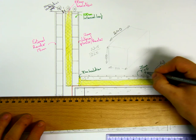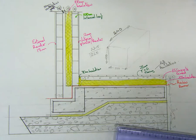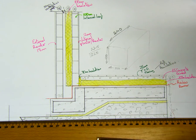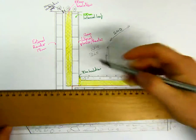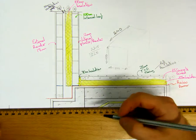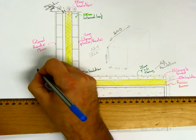There are a few very important things missing. We need a DPC — a lot of people are putting this in the wrong place, so be very careful. You always have DPC in line with the top of the foundation or just slightly higher. So underneath this block here we have DPC, and underneath that block there we have DPC. That damp proof course stops moisture rising up, and it's always in blue — mark it in blue. DPC.